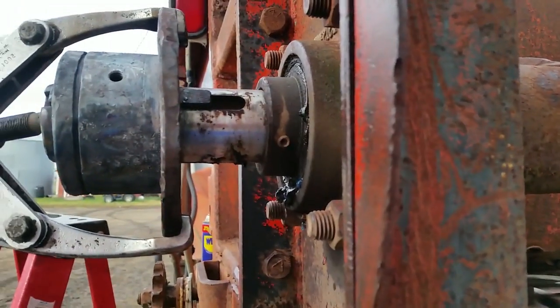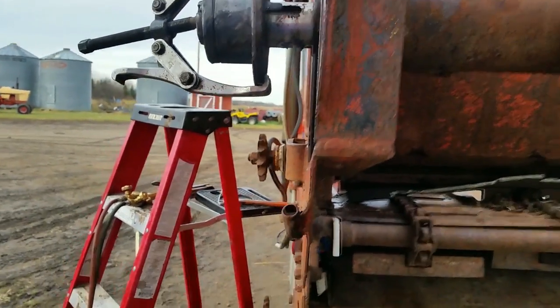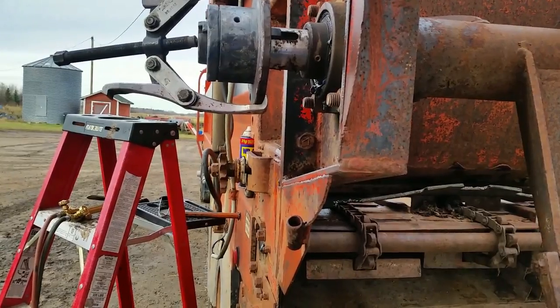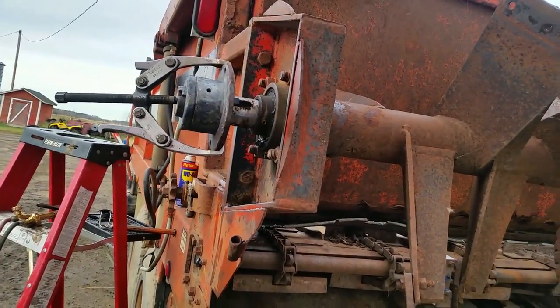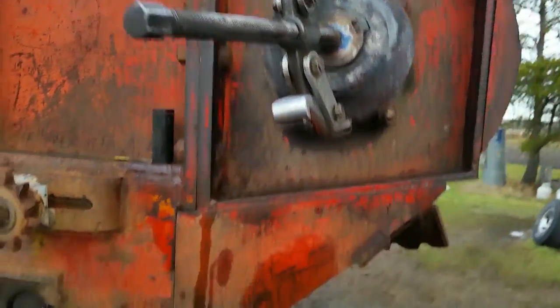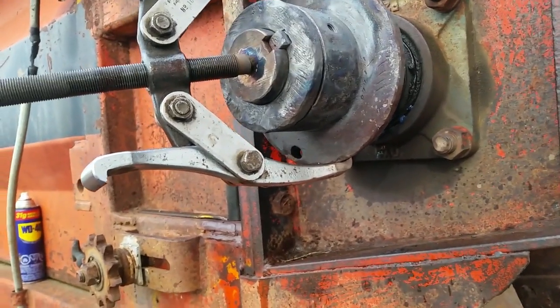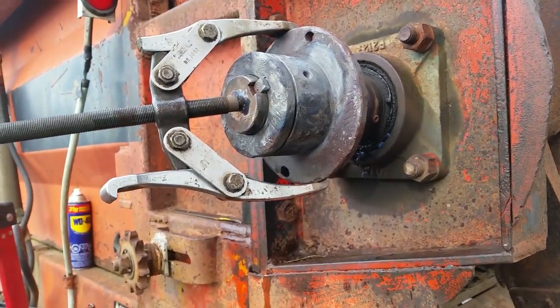That's proving to be a lot harder than I planned. It just would not budge. We were heating it, pulling — heat and pulling — and it would not move. But I did get it to move this morning, probably about a sixteenth of an inch. I can tell it snapped over, but I need a bigger puller. I tried cold water on the shaft today, heated it up, then tried cold water. This puller keeps going sideways and I don't want to wreck it — it's starting to bend already. I must have gone through half my oxygen and acetylene bottles already heating that sucker, but it did move, so there's good news.